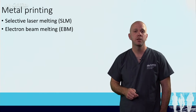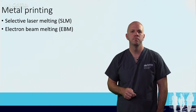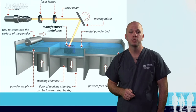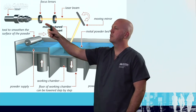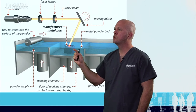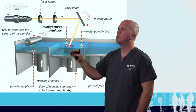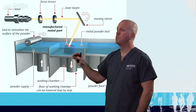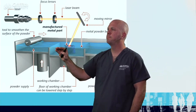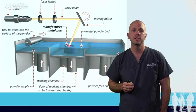Metal printing can also be categorised into two main areas in relation to dentistry. The first is selective laser melting, or SLM. It relies on an STL file as with photopolymers, but here we have a laser focused and shot onto a mirror, with a metal powder. It still shoots the same sort of layer of material, but instead of building from the bottom, it builds from the top first. There also needs to be a lot of metal support structures, and each layer of metal has to be rolled across so it's perfectly flat. This sort of printing is done in a noble gas, normally argon, to stop oxidisation between the different layers.